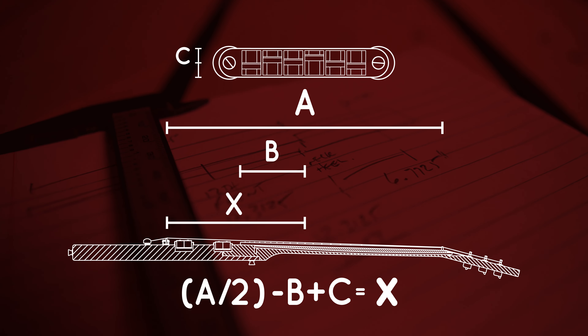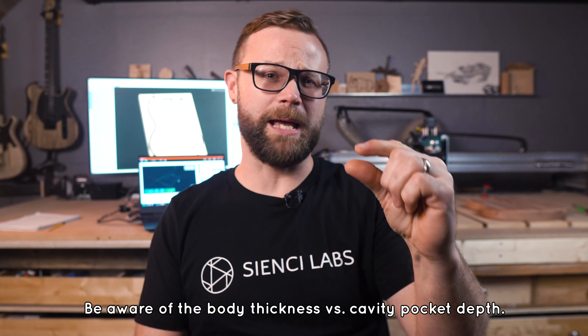To get the left and right locations I measured the bridge width from the center line on the body. I've included notes in my file to help you figure out the locations for your build. The volume, tone, switch, and jack holes were in my opinion less critical for exact placement — the files I had were pretty accurate and after my first test carve I adjusted them to my taste. The control cavity plate vector was created the old-school way: I traced around the plate on a piece of paper, scanned it, imported the image into V-Carve, and traced it to create the vector. The neck, pickups, bridge, tailpiece, back plate, and control cavity were all pocket tool paths — I measured the depth of those parts and assigned those depths when creating the tool paths.